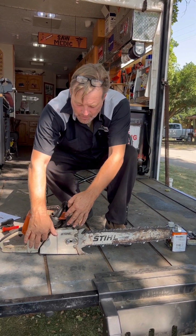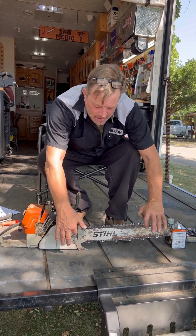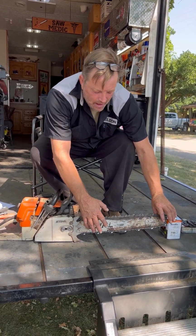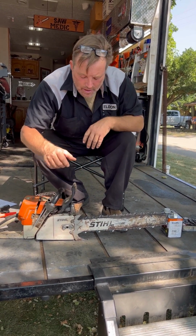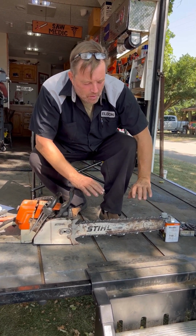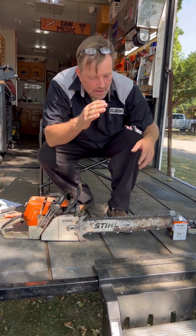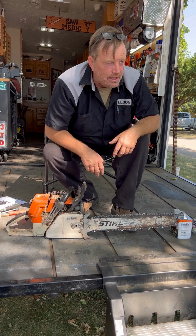And then lay the chain from the back across the front, and if you're having trouble getting it over the front, just kick it off so you get to put it on, pull it back out. You see what I'm saying? Is everybody understanding what I'm saying? Yeah. And now the chain is on there. I can let go and take a phone call, and I'm not worried. Put the cover on, put the nuts on, and now the other part is, we want to flip the bar every time we take it off. You flip this bar every time it's off and use both sides. You're having a lot of trouble cutting swoops and you think you're sharp, flip the bar. You got a good side ready to go.